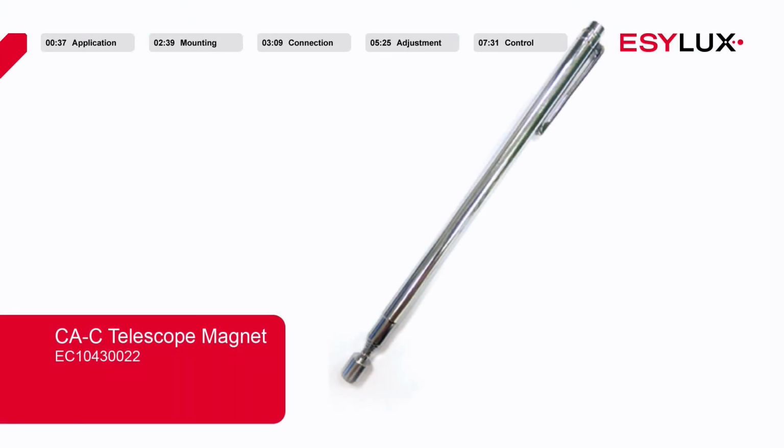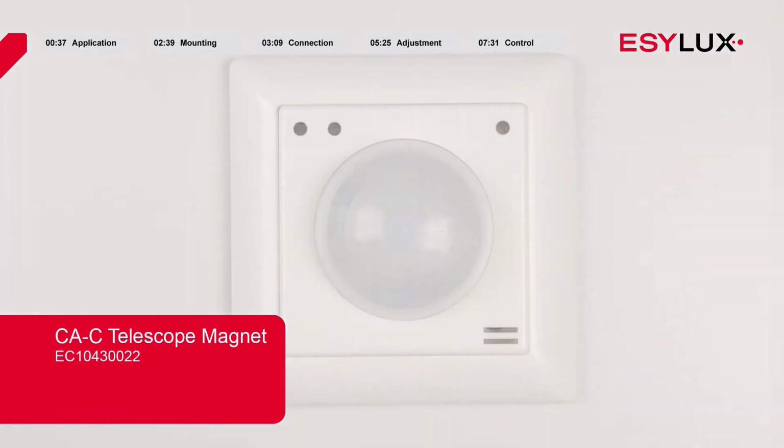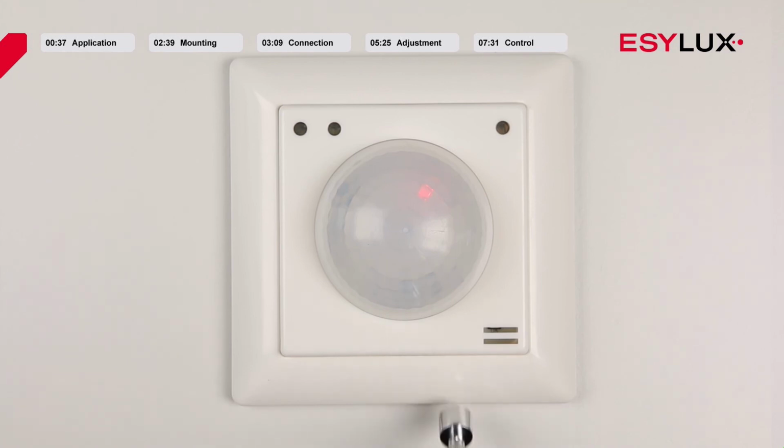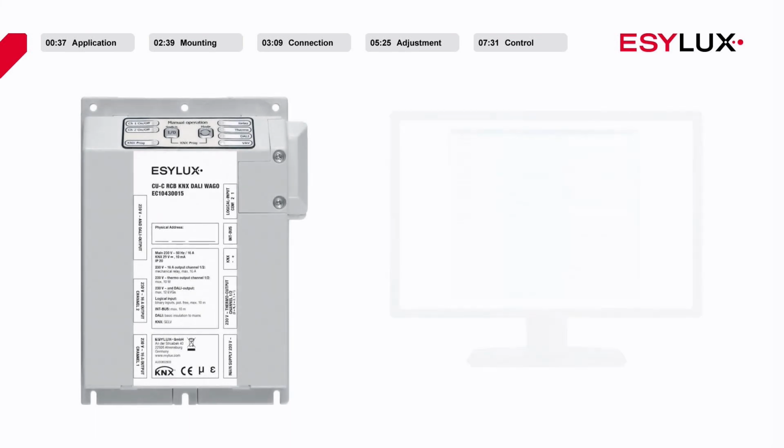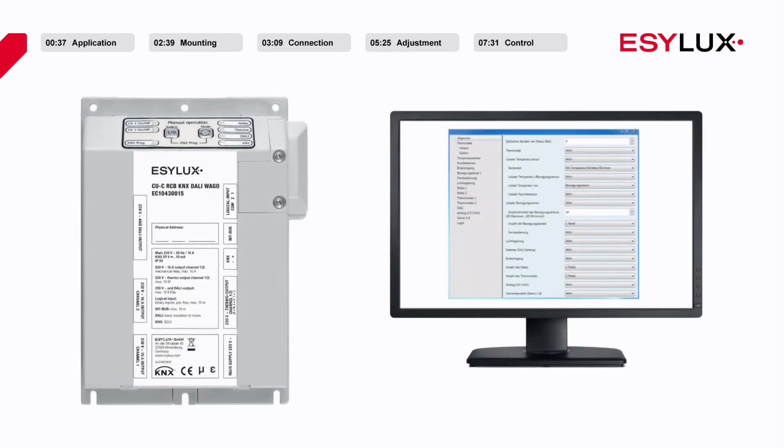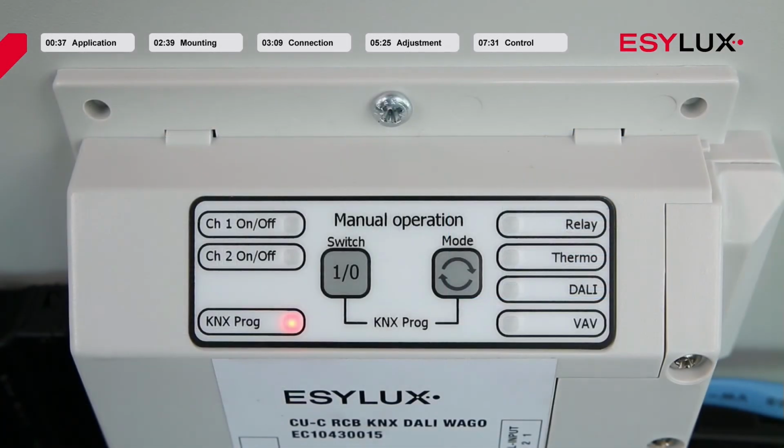Optionally, you can hold a magnet to the front of the detector to start or end programming mode. A red LED will also light up on the detector when the programming mode is active. The device can be configured via the KNX bus system and the ETS software installed on a PC. The room controller box saves settings, meaning that the devices can also be configured in advance in a different location and then installed on site.